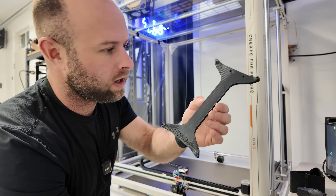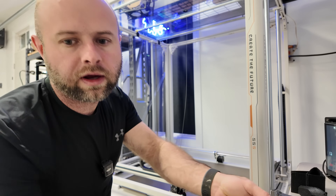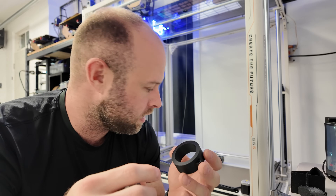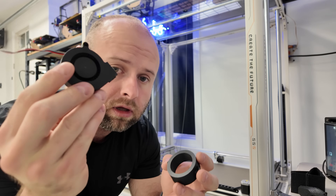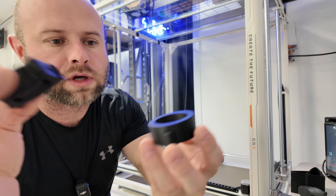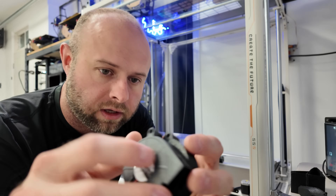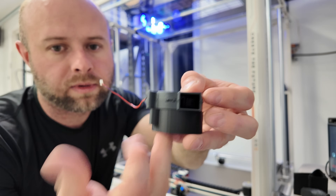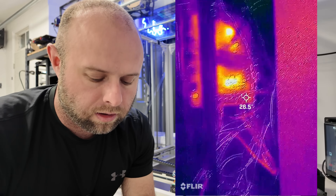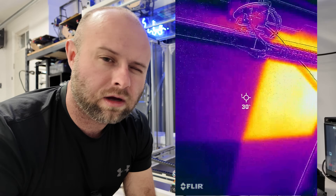I've done a lot of fabbing — for instance the Kraken mount, which is heavily modified to fit within the standoffs in the electronics bay of the Giga. I have that on there, plus a little fan housing because I need cool air in before I seal it up, and the little stock fan is kind of weak. So I took one of these little two-amp blower fans off one of the spare Giga printheads and made a housing that fits over one of those openings. That way it sits right on top of the existing standoffs, a little screw goes in, and you have cool air coming in that blows right onto the Kraken. I also pulled out my FLIR camera — I was trying to check for hotspots mainly to see if there are any areas on the board as I do the cooling process, so I know where to direct the air.